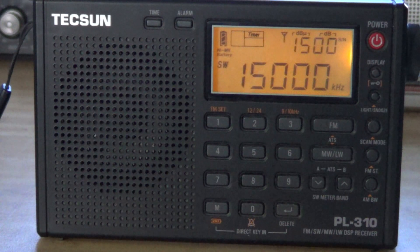It's really nice, because in a crowded area, for good audio you want the six kilohertz most of the time. But for a crowded band where stations are really close, you can actually put it in a four kilohertz mode. It does lower slightly the quality of the audio, but it does improve a lot the reception of the station, because it will cut out nearby stations that are trying to interfere.